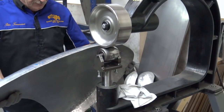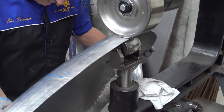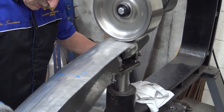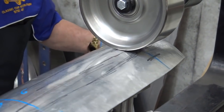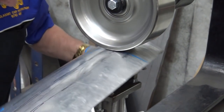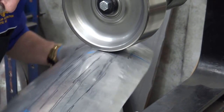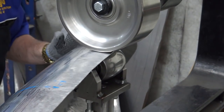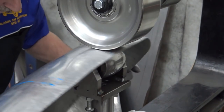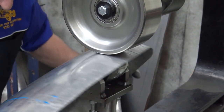You have to get yourself a start position. So now we're going to go in there, wheel in there, not just on one spot, but all over. And I'm going to wheel in there. The pressure is the same. I'm only working with my hands and pull it down a little bit, not too much. If you have too much pressure, you're going to put lines everywhere.